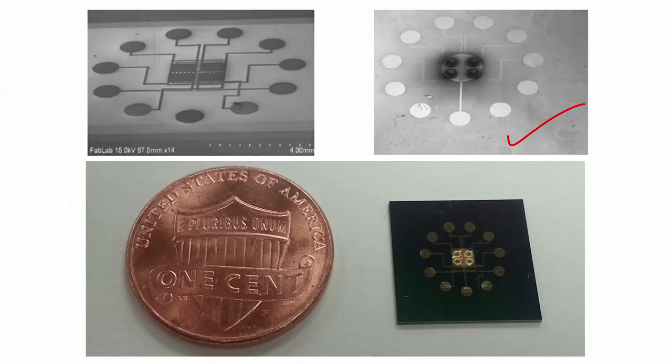To create these pillars, we will be using a technique you already know — photolithography. These pillars are made up of SU8, and they are non-conducting. Why? Because SU8 is a polymer — a non-conductive polymer.